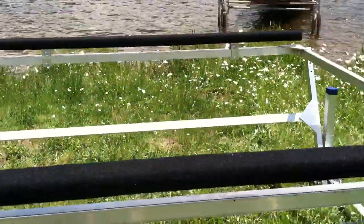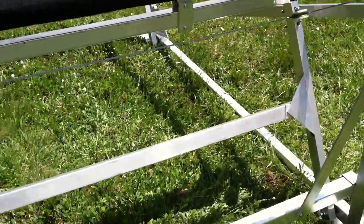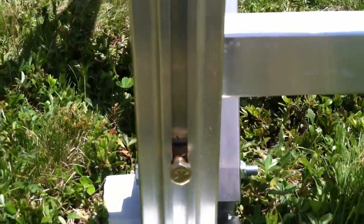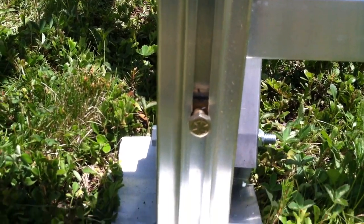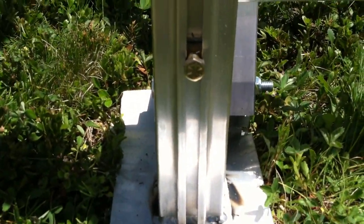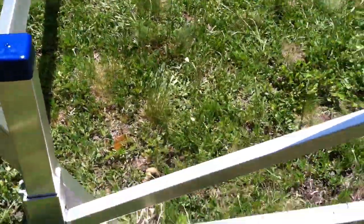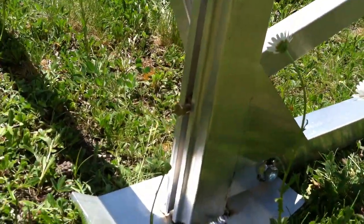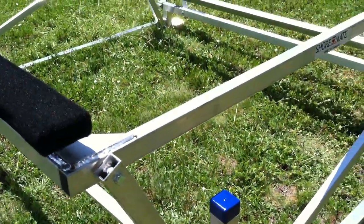It took more time just kind of figuring it out since the directions weren't accurate, but I think with this it should help. For leg adjustment — pretty simple. You've got this bolt with a T-nut in it that goes through a hole and pinches the vertical leg. You've got height adjustment here and on all four corners. Once you get the lift in the water, you can just loosen that bolt and adjust your height accordingly, then tighten it back down. I hope this helps — if you have any questions give me a call. Thanks.